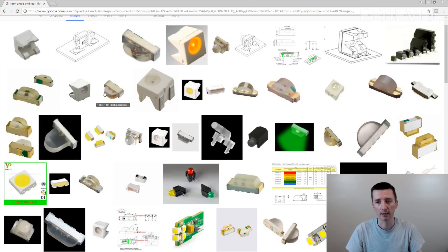When I was starting with hardware design, I used to put support for light pipes, but that takes quite a lot of space. So I moved to placing the LEDs on the edge. Sometimes it may be difficult if the panel is a little bit further from the PCB — then maybe you'd want to use a different solution.